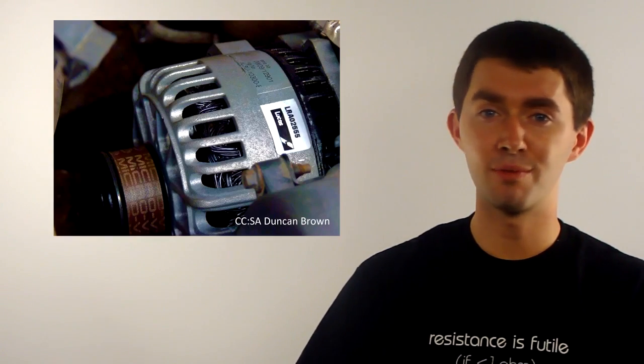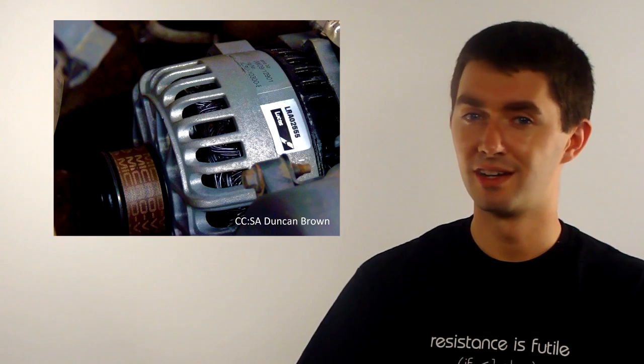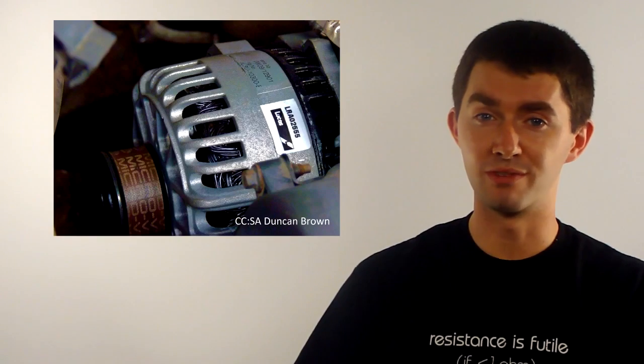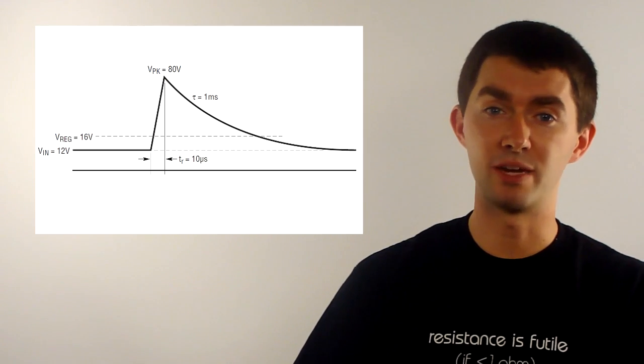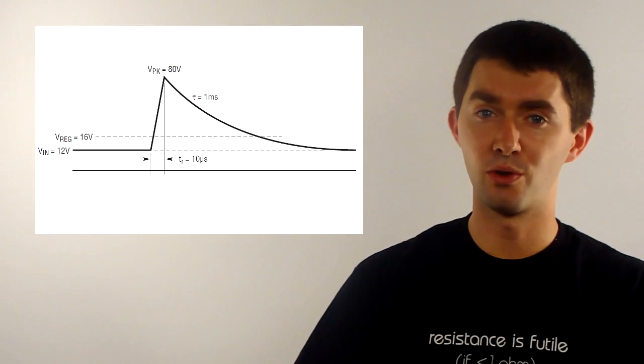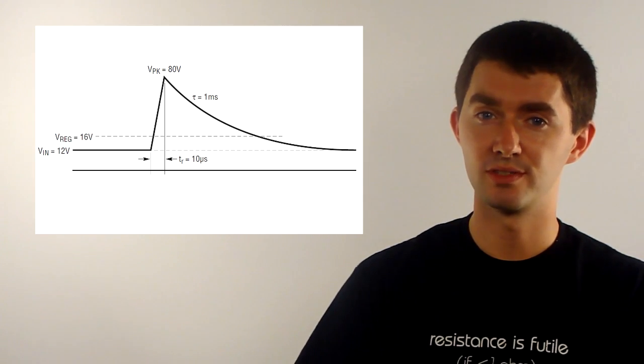It's meant for applications where you're really sensitive to an overload, or you have a really big overload that's coming into your circuit. A good example might be a load dump from a car alternator. You can get lots of voltage and lots of current, and you can blow up your circuit boards really fast. The ideal diode refers to the behavior when it clamps, so it's actually a really low drop in the sub-millivolt level. And it can take from 4 volts up to 80 volts on the input in terms of a surge, so it can really hold off quite a lot of input voltage.